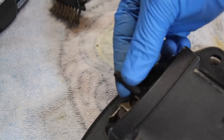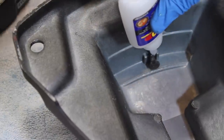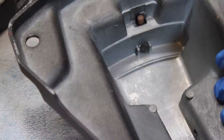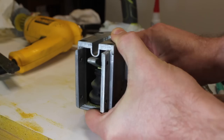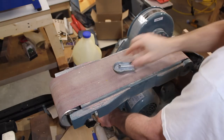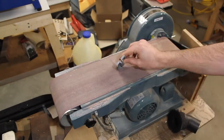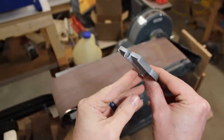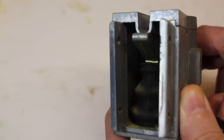Now the base — this is an optional fix. There's a minor design flaw: this screw is not captured in there. Sometimes when you're putting the trunnion tension knob back on, that'll pop out, and then it doesn't sit properly and you can have issues getting your table nice and stiff. Now here's where noise can happen in your machine — notice how that tops out. Remove these four screws — that's Torx 20. Then grind down at an angle that lower part. This will not hurt your tool or damage it in any way. It just gives more clearance to be quieter. It will only smack the top roof if it's going really fast, but that little bit will make your machine much quieter.